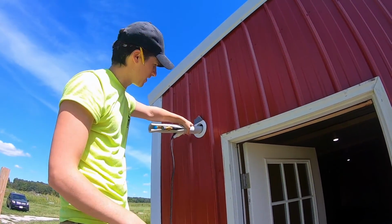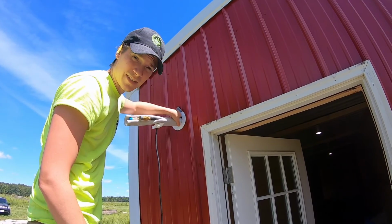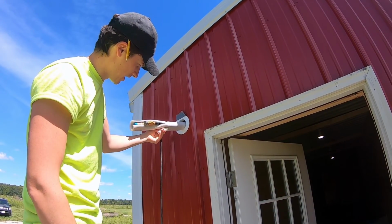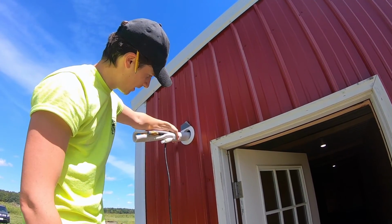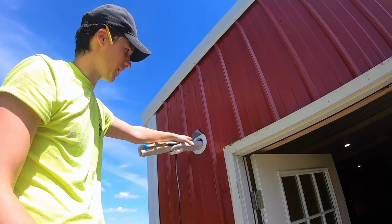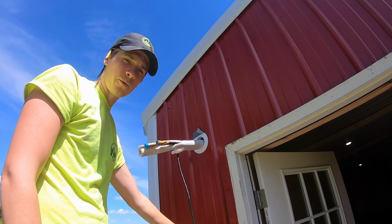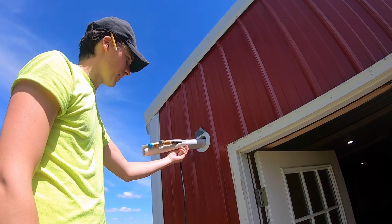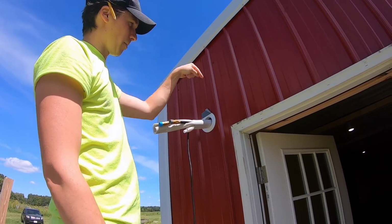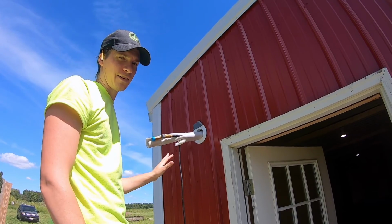One thing that you can see is I wrapped this tubing up with the communication wire and the drain so that the drain is going to be on the bottom of these coolant lines. Basically we're going to gently try and bend these downward, and this just makes sure that your drain's not going to have to go up and around so your water doesn't have any issues.